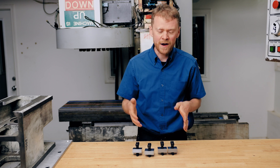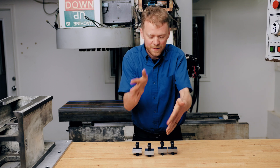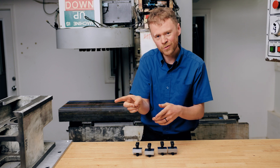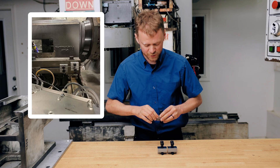But if you don't, you may want to get a pair. Because if the turret runs into the spindle, or you run down to the tail stock, the turret can get crooked and then your drills aren't straight, your turning tools aren't on center — you'll need to adjust it. It's really easy with a set of push-pull blocks.